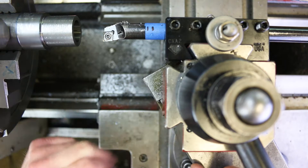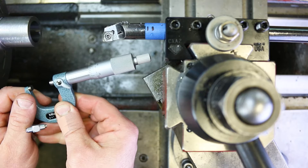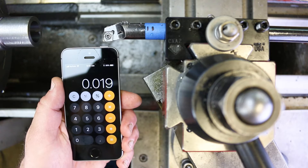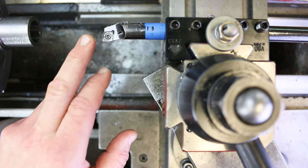That's telling me 851 thousandths. So we're at 851 right now, and before this cut we were at 832. We told it to take 20 thousandths and it took 19 — pretty close but not perfect, probably because of the chatter causing tool deflection. So I'm going to half my cut — instead of taking 20, I'm going to take 10 because I don't have much more room to play with in here.